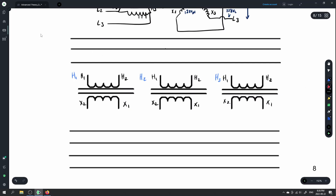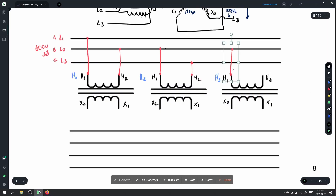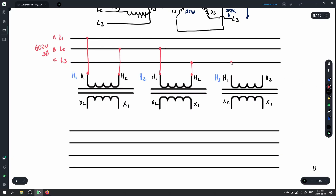We have three phase coming in — usually 600 volts — line 1 to H1, line 2 to H2, line 3 to H3. On the inside, the manufacturer has created the tie-in between each single-phase winding on the common core: A to B, B to C, and C back to A. Those internal delta connections are all done internally.